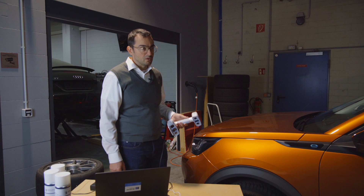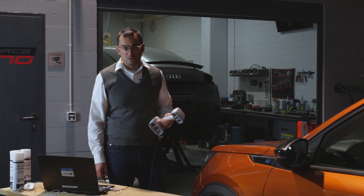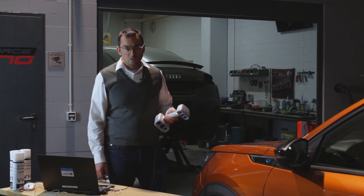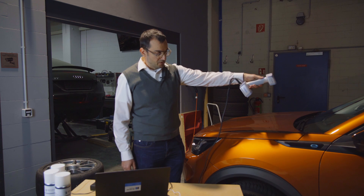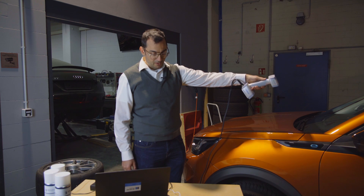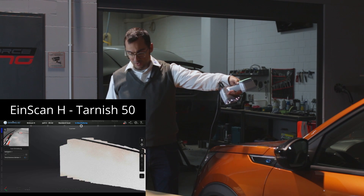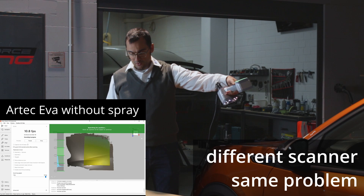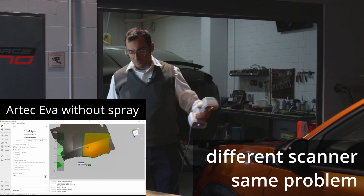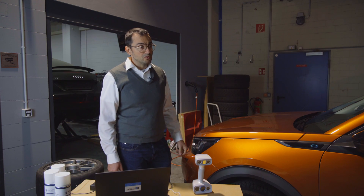Scanning a car hood without any markers is rather difficult, especially when you use a scanner that is just using LED light or infrared light. Just to show you how it would look trying to scan the surface without any kind of surface treatment or topo spray, we're going to do a test run before we spray it. I'm going to start at an area where there is rather more geometry that the scanner could use for tracking — I have activated tracking over texture and geometry. You can see that as long as there are some features visible the scanner is keeping track, but this is a very small area and if you try to move in any direction it loses its path and doesn't return — so no possible way to scan that.